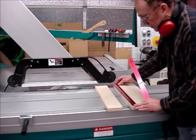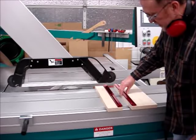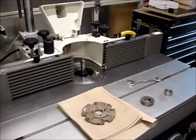The next step will be to cut the dados for the T-slots. I'm going to put the track right up against the end so the scale is closest to the edge. Instead of having a rabbet for the T-slot, it will actually fit in a dado, and I'll do that at the shaper with the adjustable groover.